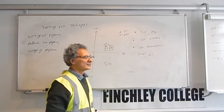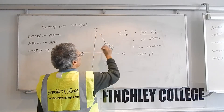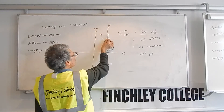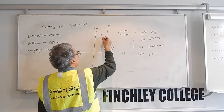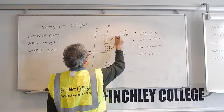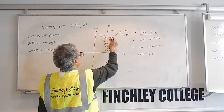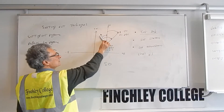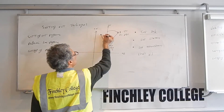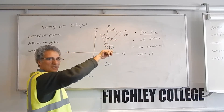When you go to start, the instrument at the moment may be pointing in one direction, and you want to set out a different point. The North is here, so the instrument draws the North parallel to the actual North. The instrument calculates the difference and angle between what it is now and the North, and the bearing is calculated from the North to that point. So it will give you the actual angle to turn from where it's pointing at the moment to where it should be pointing. For example, if this is 20 degrees and this is 40 degrees, it will show you plus 60, meaning turn 60 degrees clockwise.